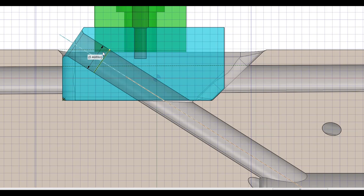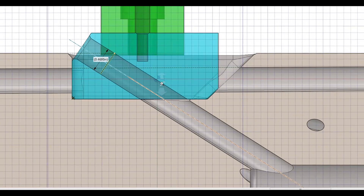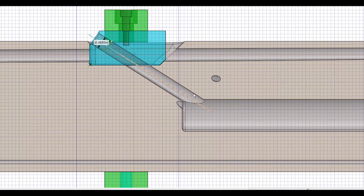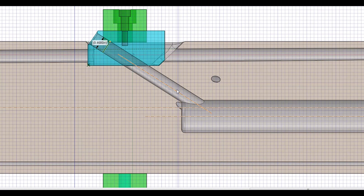The first one I did this on I actually drilled this hole down into here a little bit and then started the gun drill, but there was enough of a misalignment - like you saw in the last video - that it caused the tip of the gun drill to break off. Also the hole kind of intersects this other hole at a pretty shallow angle, and it actually has to drill through this, which might be a little difficult on the drill. Although a gun drill seems to work well for this because it gets support from the drill tip to handle this kind of intersection better than a twist drill would.